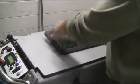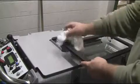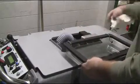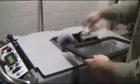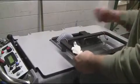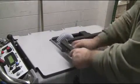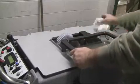Once your recovery tank beads and seals have been cleaned, it is important to lower your recovery tank lid and clean the sight dome, as demonstrated here. It is important to clean the bead and seal assembly. Next, clean the dome and ensure that the dome chains are in proper position when replacing the sight dome, as shown here.